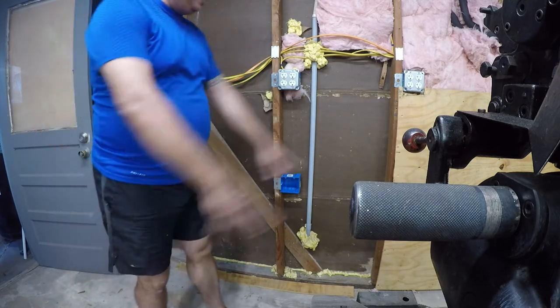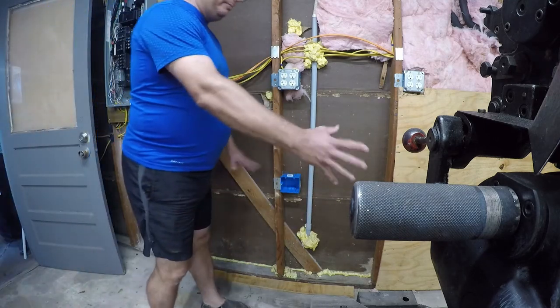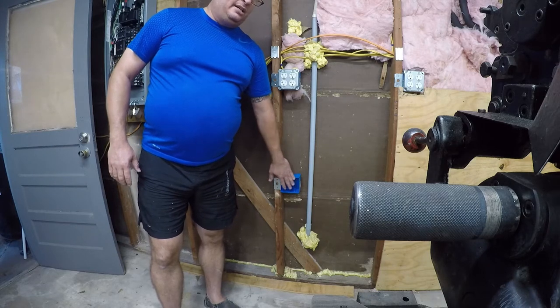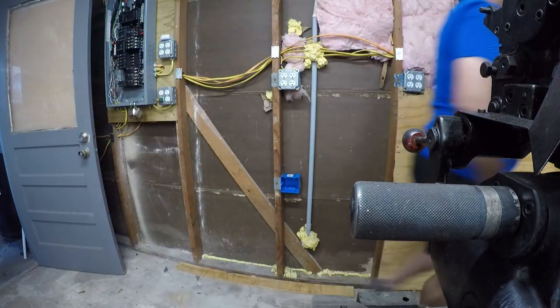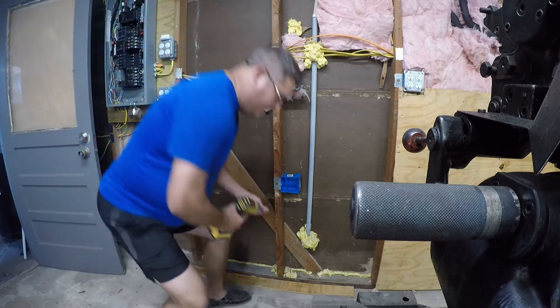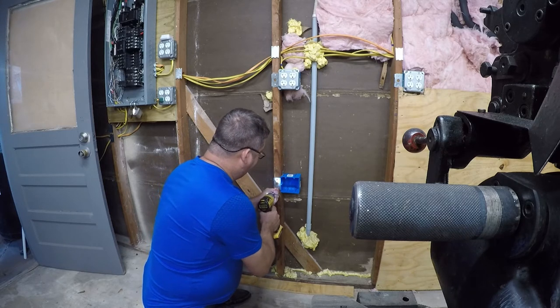That's the right spot for it. I want it over there. I don't want it over here. So that's why it's going where it's going. This machine's going to come back, and I'll probably move that way a little bit. So that'll make this very easy to get to. And this is my means of disconnect as well as my... you know, when I have a means of physical disconnect, it's considered lockout, tagout for safety reasons. Now, what I'm doing is not subject to OSHA's rules, but OSHA's rules are there because somebody got hurt, so they're generally not a bad idea to follow.